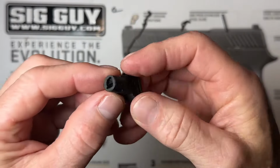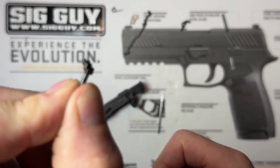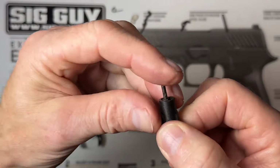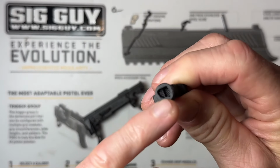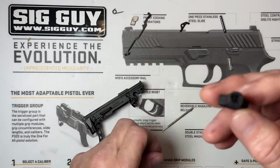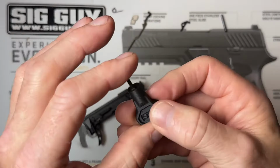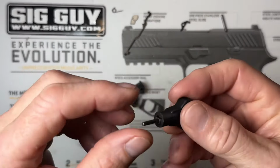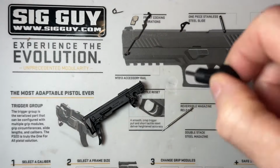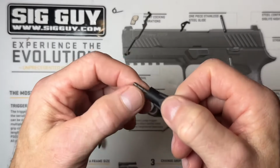The notch in the bottom there is basically the same shape as our pivot pin. You can see it's got a step in it. Well, there's a step inside there too. So you want to make sure that it goes in there nice and straight up and down. If you're crooked, there might be a little piece of support material left in there. Just take your slave pin and pick that out of there. I try to make sure they're all perfectly clean, but obviously I'm human and humans make mistakes. So if that doesn't fit in there nice and straight, just look in that hole. There's probably a little piece of support material. Anyway, I make things snug so that this will hold my pivot pin without falling out, but we don't want it so snug that when we go to pull this out again, it pulls our pin out with it.